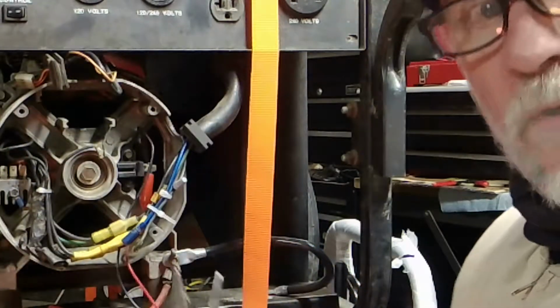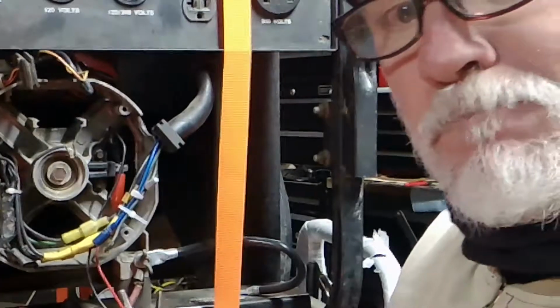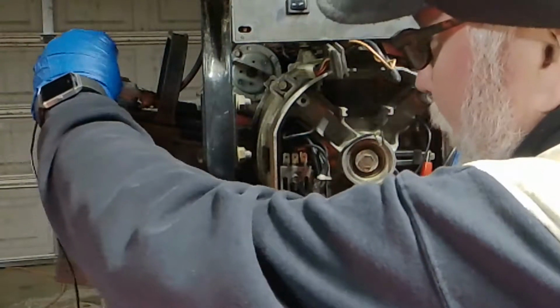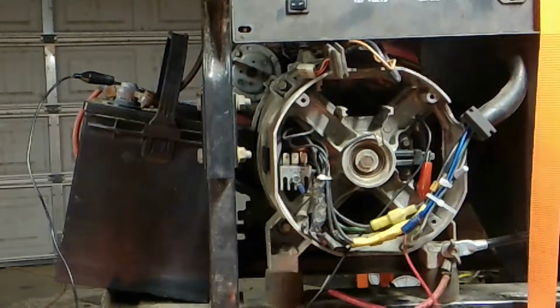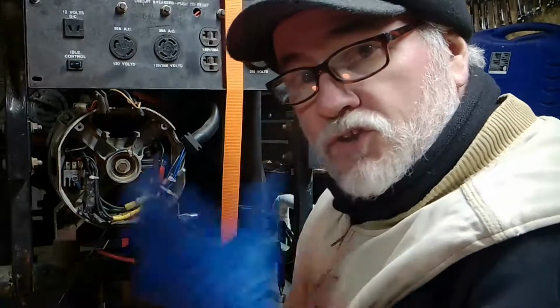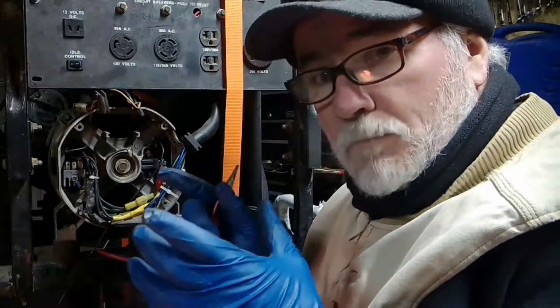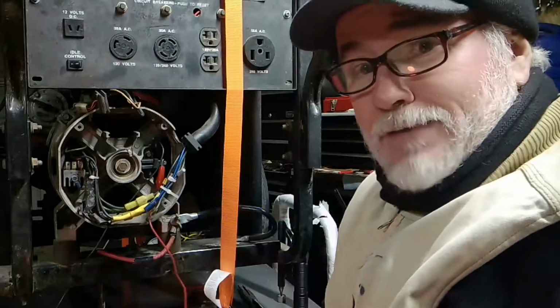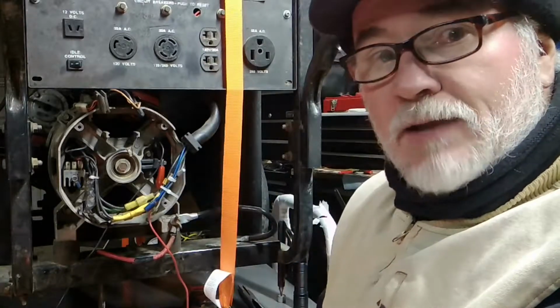We want the negative hooked up to the battery right now, and I'm going to do it. And check this out. This has a freaking truck battery hooked to it. No lie. He's got a truck battery. We're hooking up to the negative terminal. So I busted on him when I saw that, the truck battery, right? But in seriousness, in the cold weather, you need your cranking amps. Car battery, truck battery works the best. Those little lawnmower batteries sometimes don't do it. And then you got to go out and jump start or charge it. So it makes it freaking heavy. But yep, he got the cranking amps that he needs, okay?